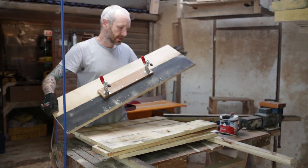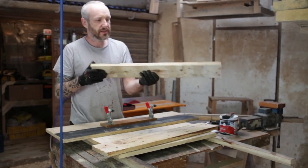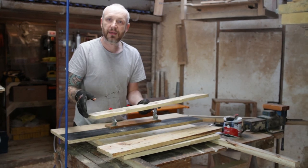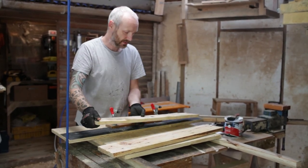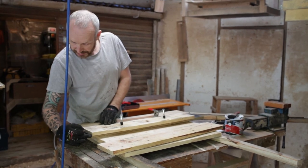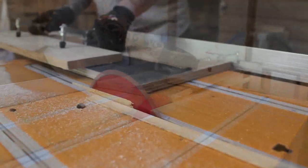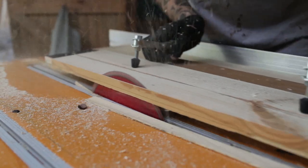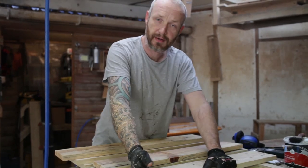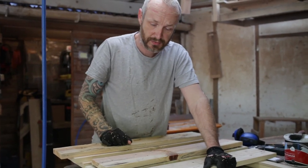So this is my DIY jointer sled. I don't have a jointer machine — they're very expensive, very nice, but very expensive. Pallet boards are quite wonky; some of them are really bad with like a banana shape to them. These aren't too bad, but to make it look tidier I'm going to make sure the edges are nice and straight. I'll shove it in here, clamp it down, and run it through the table saw — it'll reference against a nice straight edge and translate to a nice straight edge on the board. I've cut both sides now so they're straighter — nice and flat — and that means they'll stack up nicely and reference against my mitre saw fence a lot easier too.